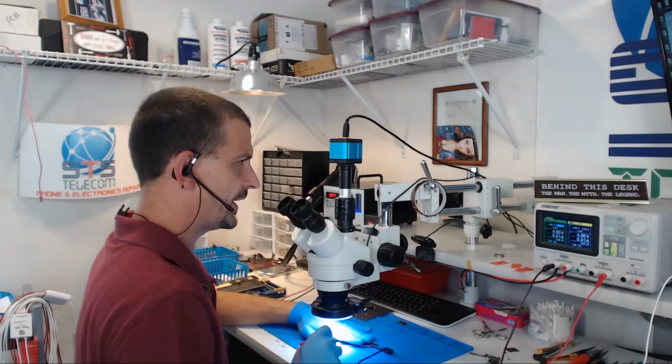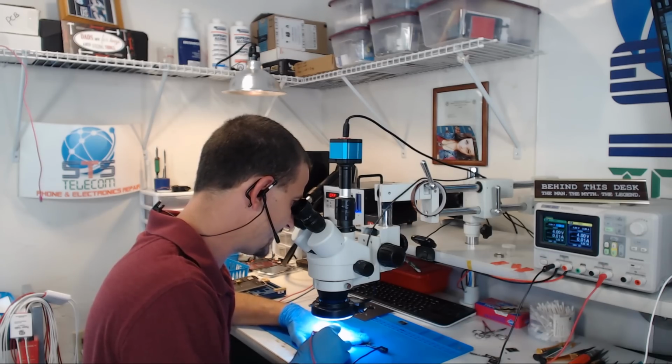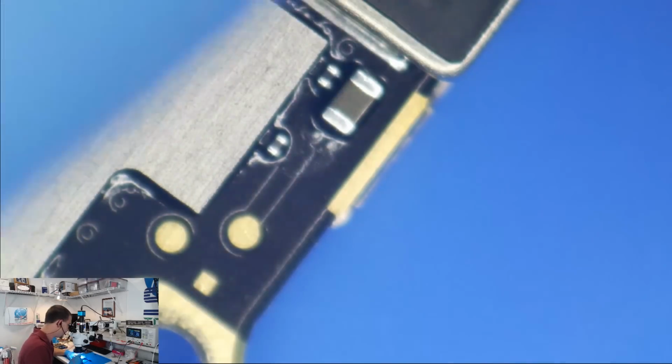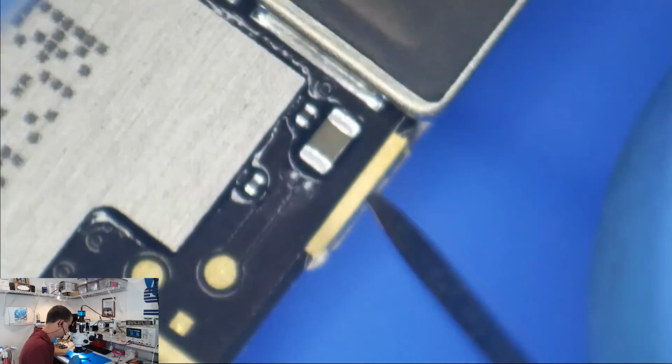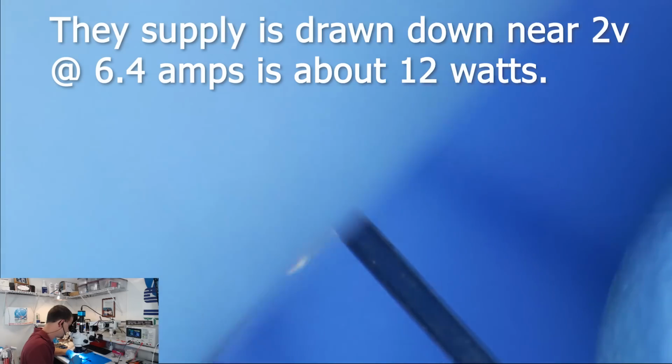And we are now putting out 4 volts, and we're drawing 0.1 amp from each channel. And I'm going to take my VCC main probe here, my anode, my positive lead, and I'm going to touch this little cap out here. And I've got my hand laid across the board, and I'm trying to figure out which end of the board heats up. It jumps straight to 6.4 amps.